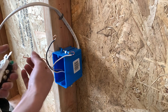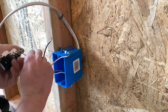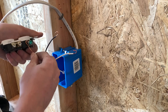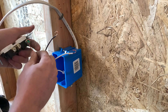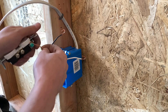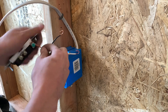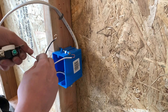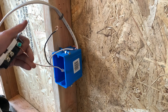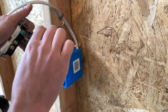Once you've got that, go ahead and put the curl over the screw. You're going to want to put the curl going to the right side, because when you twist the screw it goes to the right. If you put it on the left side and tighten it to the right, it's going to back the curl out and you have a potential of having the wire fall out. So screw it down with the curl on the right side.